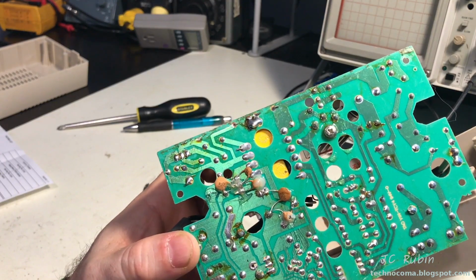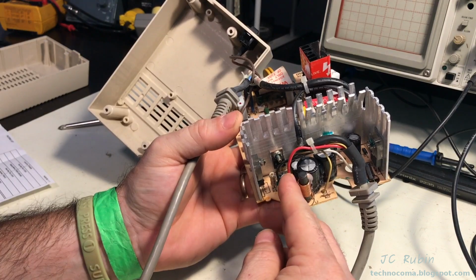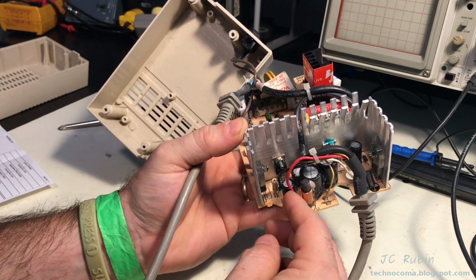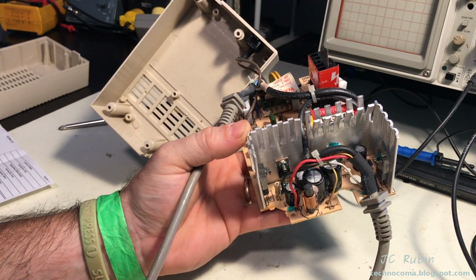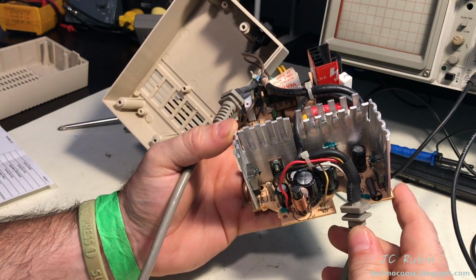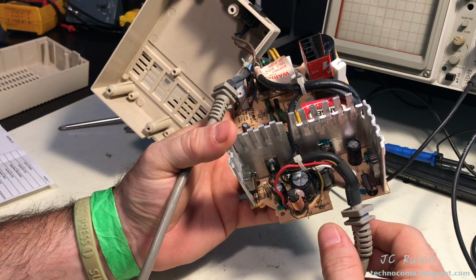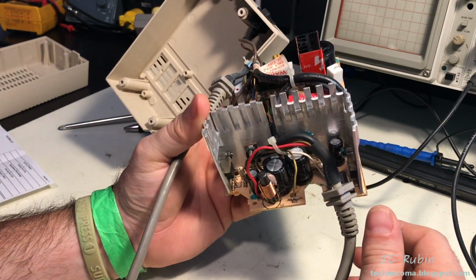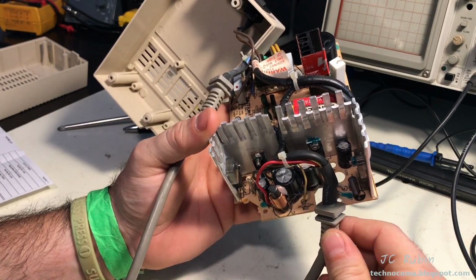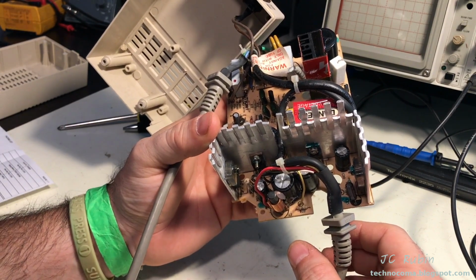As I mentioned earlier, this unit was the Type 2 with the 4.5 amp rated on the 5 volt. I went and checked. The Type 1 was only rated for 2.5 amp. That means that the overall rating of this is 37 watts, where the previous was only 25.7. I could compare this to other Amiga power supplies that are also of a lower wattage than this, but it's apples and oranges because you're also rating it against a different model computer. But based on the power supplies provided on the list, this one has the highest power rating of all of them.